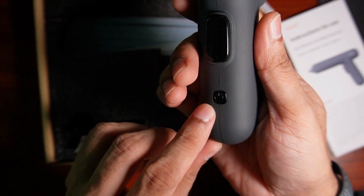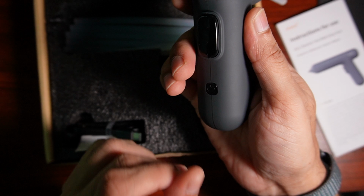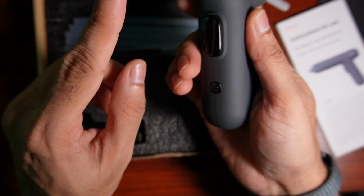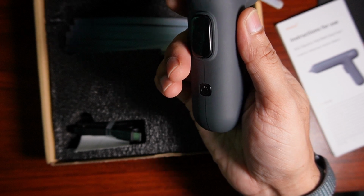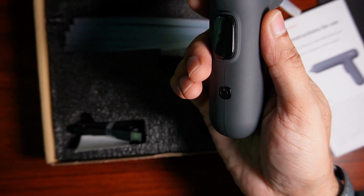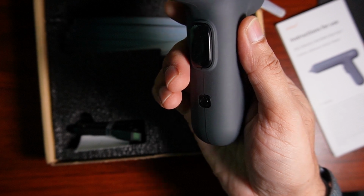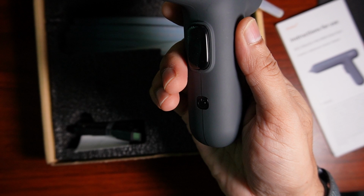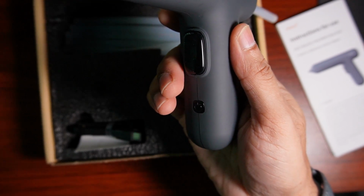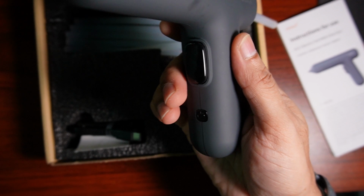So how it works is, you first turn on the unit by pressing this for 1 or 2 or 3 seconds. So it will turn on, and then when it turns on, it will start heating the element, and the LED will be red. That's one of the things that's lacking in the cheap mains powered unit, there is no sensor. It's all based on temperature regulation through transmission, or regulation through something. What essentially means that it heats up the element. It keeps on heating the element, and the heat will keep losing by contact through the atmosphere and the plastic and the glue, and all that acts as a regulator, if you can say that. That's the only thing that is there.